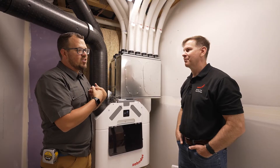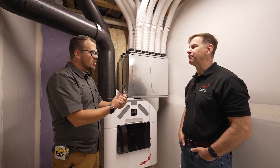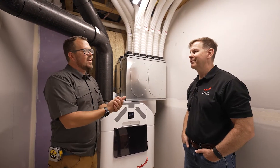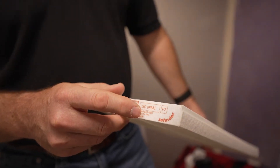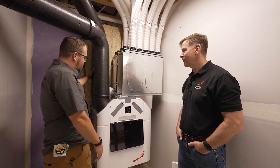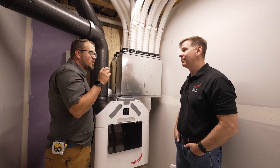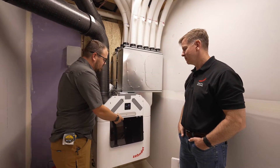We say we're bringing in fresh air but we can't guarantee it's fresh — if I just have an eight-inch hole in the wall I'm bringing in outside air but can't guarantee it's fresh. So the first step in the system is basically a MERV 13 filter for the air coming in from outside, which runs through that filter before it gets to the core. Now that air is filtered — pollutant-free is the best way to think of it.